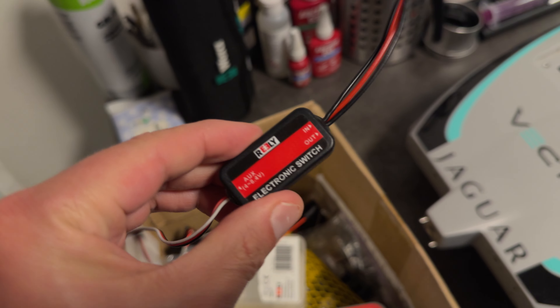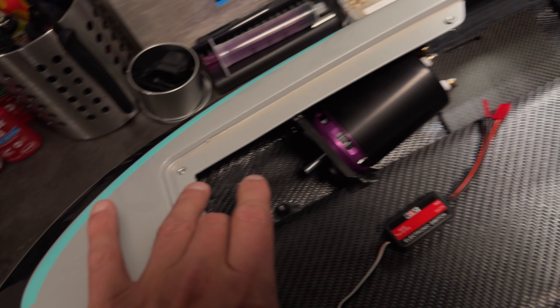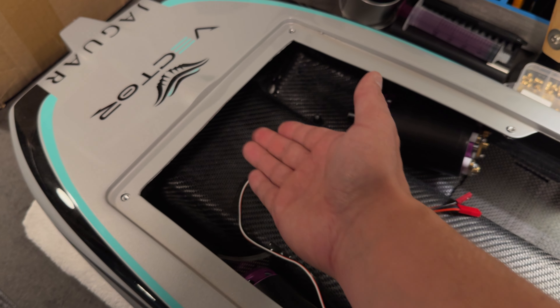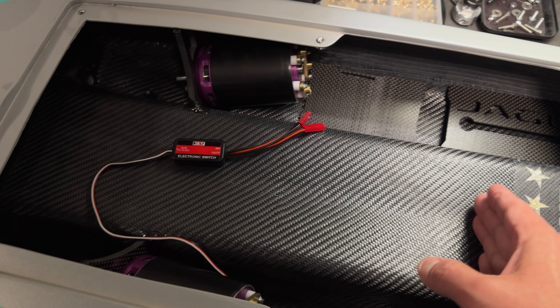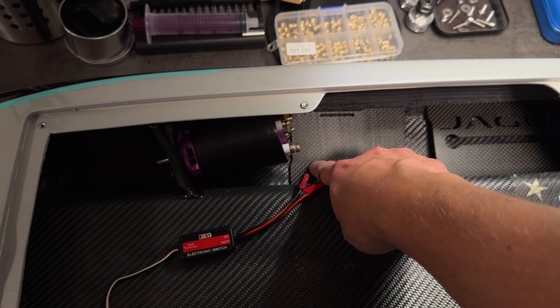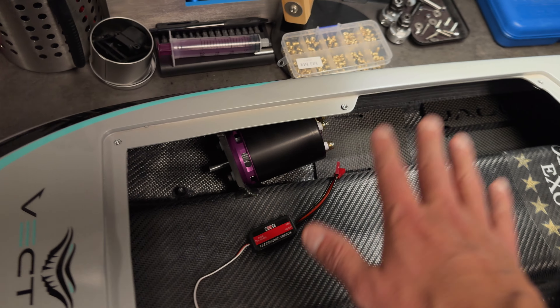Basically this is a box with all the stuff that needs to go in. This is a relay that needs to control the pumps — I'll be running two of these pumps, which will sit inside the overhang. I will have a solid middle section with full carbon, going all the way from up here where the servo will sit, all the way to around here where I will have all the electronics hidden away — as close to the motors as I can get them, to keep the wiring to the motors as short as possible and also to keep the center of gravity low.